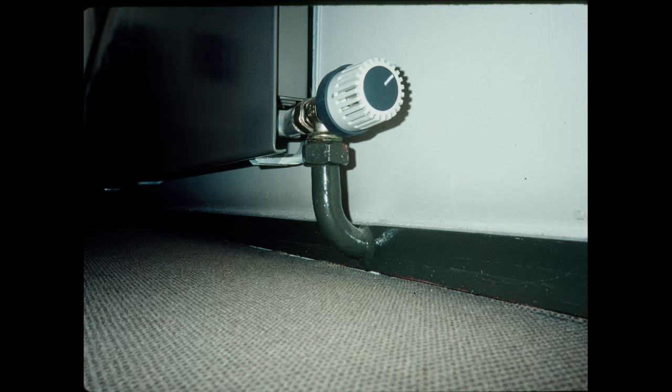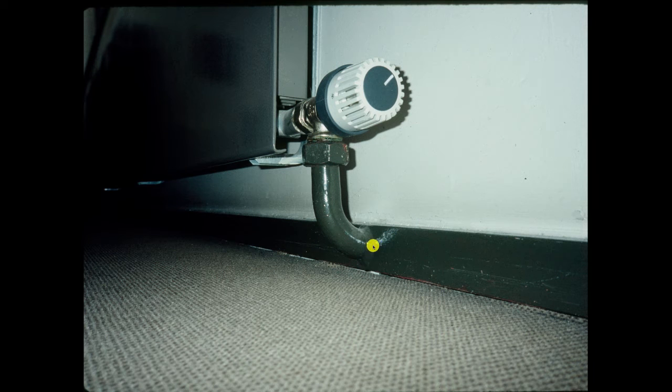So we're looking at this thing, and I'm just marveling at the wonder of it all. And my friend says to me, ask him, how does he get the water to flow through the radiator and not through the square pipe? There must be some kind of a diverter tee in there, or something. There's no monoflow tee or anything in the square pipe. But what makes the water flow through? So I asked the translator, and Mr. Geyer writes on the flip chart, delta P, meaning that the difference in pressure between this point and this point is greater through the square pipe than it is through the radiator, because the pressure drop through panel radiators is almost non-existent.